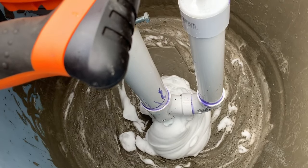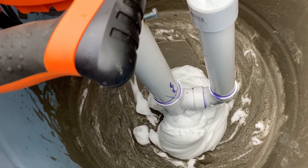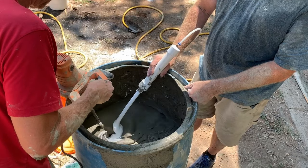What is AirCrete? AirCrete is a cement product made from trapping microscopic air bubbles inside of a Portland cement matrix. This is done by mixing Portland with a shaving-cream-consistency foam, which can be made with dish detergent or more industrial foaming agents like Drexel. I'll put a link to these things in the comments section below. The resulting material has an R-value of 6 per inch, which is pretty astounding. For context, foam board would have an R-value somewhere between 3.5 and 5.5 per inch.